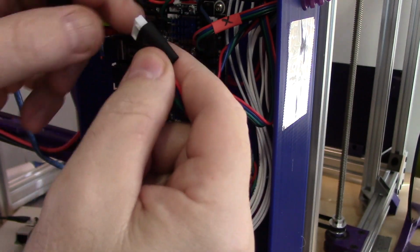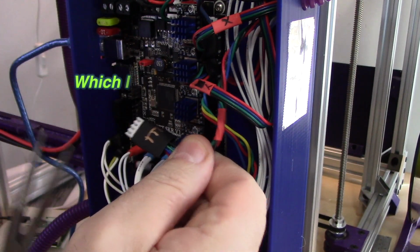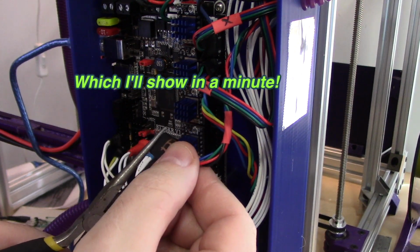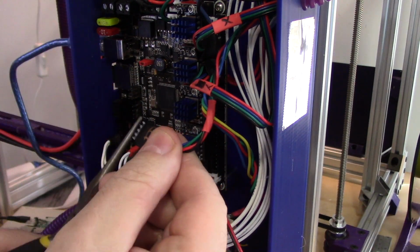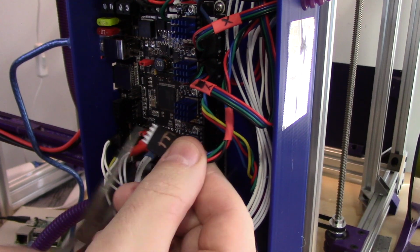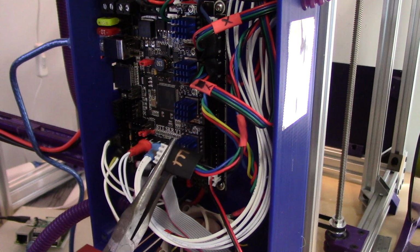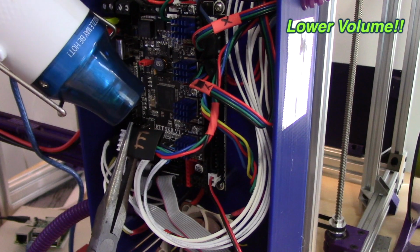And this is kind of the weird part. If you leave it too long, it'll stop it from plugging in, and if you leave it too short, it'll pop over that lip in the actual plug and it'll miss. And I found if I squeeze it a little bit, I can feel the lip, and then I can squeeze back and I can feel how much is past, and that should be about right. And what I do is I just hold it on the lip, and that's usually enough. Not always. And then shrink it down.